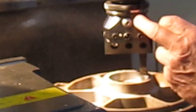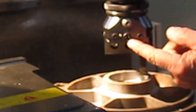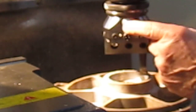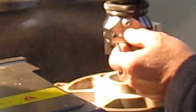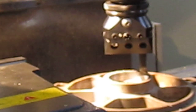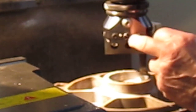There's one thing to remember: this is an automatic, and at the moment it's set on manual. It has a little locking screw here, and it's extremely important to release this every time you adjust the boring bar. Right now I have to adjust the boring bar by one turn — I'll make sure that's released and then I'm turning it through zero back to zero again. That's the amount of cut I'm doing; this is stainless steel by the way. Then I'll lock that. It's important to remember because you can damage the small gears inside if you try to wind this against the lock.